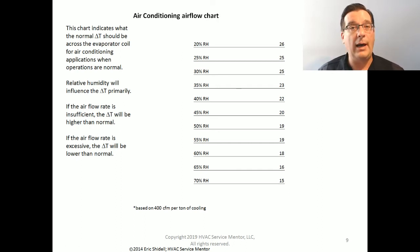If it's real dry, like down here where I live, sometimes we get real dry down in the 20% range. And then having a 26 degree delta T is normal under those conditions. So your temperature difference through the evaporator coil is going to change based upon the operating conditions and the relative humidity. The other thing that changes it is, look here,